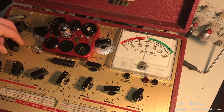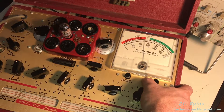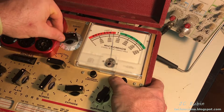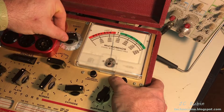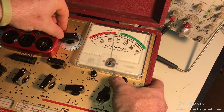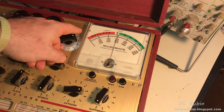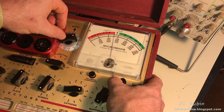I'm going to make sure my line test is set. Given that I can hit the test button and it's showing 1250, how much can I be off on the shunt and how much will it affect the reading if I move it slightly? I'll use the top dashes for reference, get right on 3000, and move it to the edge of each side. It's almost as if the meter moves the same distance as it's off on the shunt — the thickness of the dash is roughly the same as how much it moves on the meter.